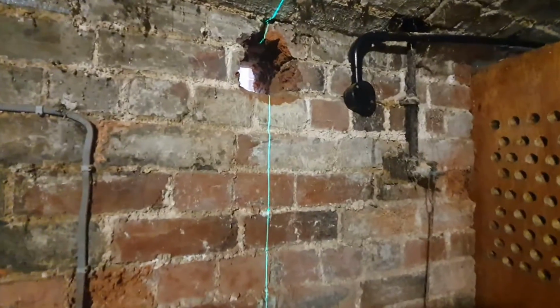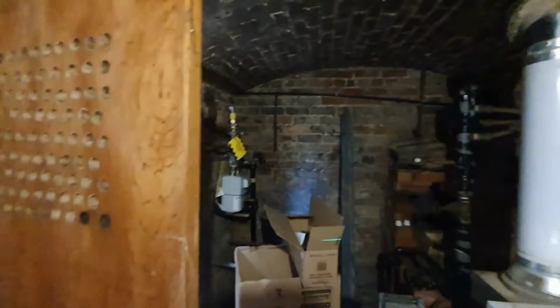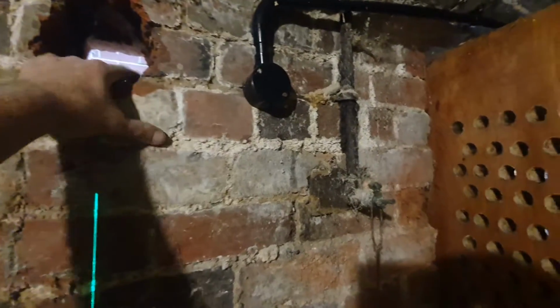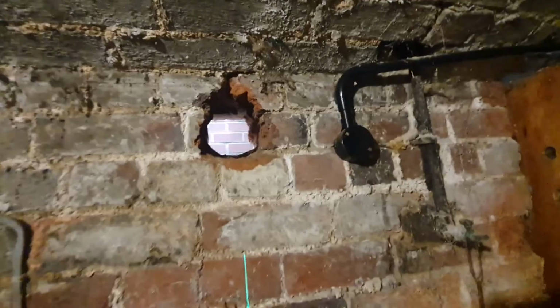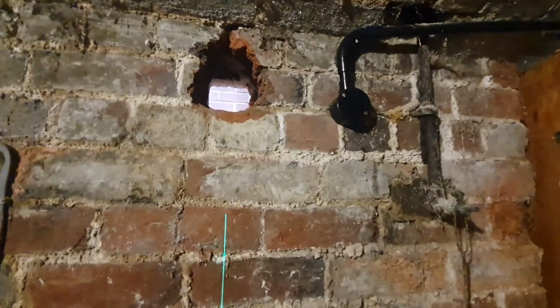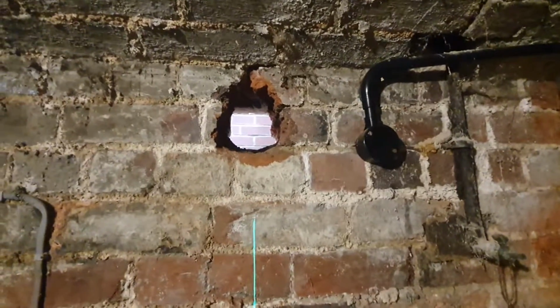I've just got my flue hole drilled out now because I've got no power down here and I ain't got keys to the church yet. I stitch drilled it out, but I can make it good anyway. It's quite a neat hole really. But you always have to sand and cement it on the inside and the outside anyway, so it's no drama. I stitch drilled it from both ways, so it's not too bad.